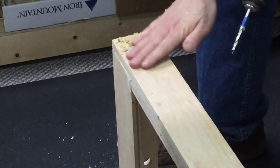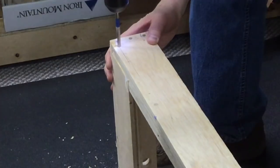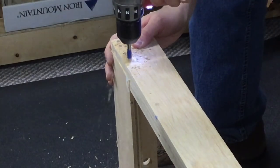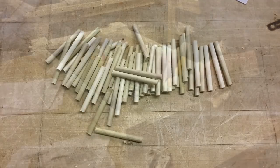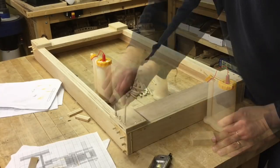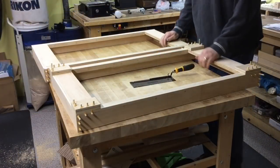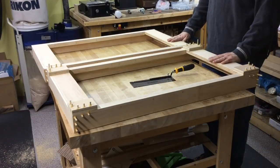More drilling, more gluing and wood pins. Since this table is built out of plywood, I want to make sure that I reinforce all the joints and corners really well. This probably isn't even half of the wood pins that I've put into this thing. I make sure that I get in pins from all different directions — the sides and also up from the bottom. It doesn't take a long time to do, and it really helps reinforce those corners. Yeah, maybe I went a little overboard on the wood dowel pins — you don't want to see me cut all these and sand them down, that would be kind of boring.